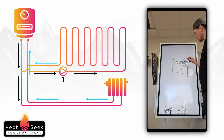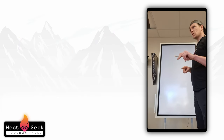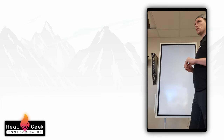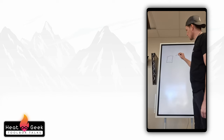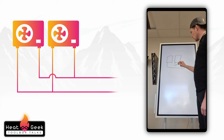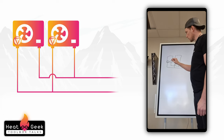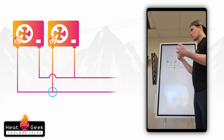If we're putting on weather compensation, the best scenario is probably to put an electronic mixing valve in. On heat pumps in series, you would use a buffer. We worked out you have to use a buffer with heat pumps in series — not just because it's the rule, but because the pumps will interplay. If you've got internal pumps on both heat pumps, those pumps will interplay: at the junction point they'll feed back on each other. We're going to find out about that very soon.